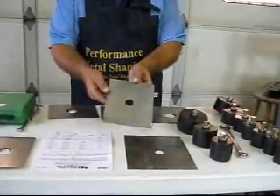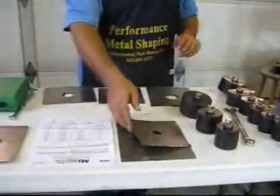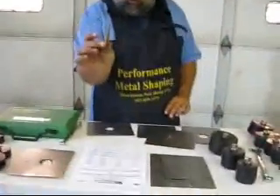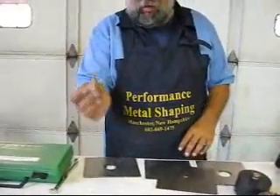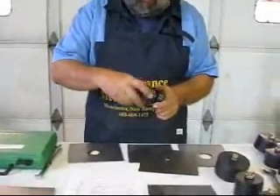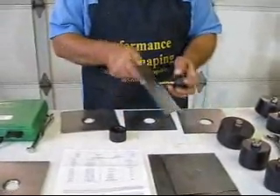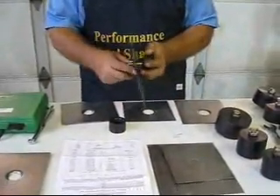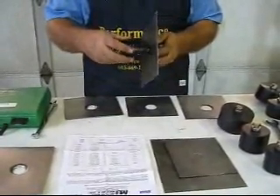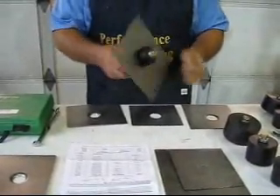Also with this tool you can punch a hole. First thing I do is drill a hole using a step bit — you can use a 1/2-inch drill, but I find step bits work really well, right up to 1/2 inch. We're going to use the automotive tool here, put this right through the metal, put the cutter in this way, and screw this into the back on the flat side. So this is working like a mandrel.